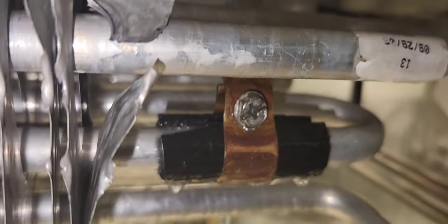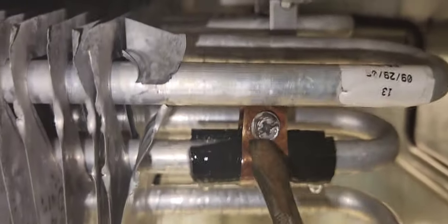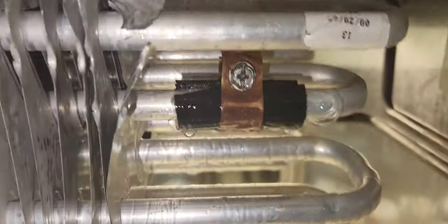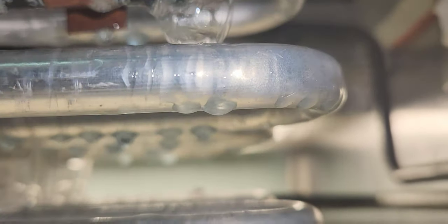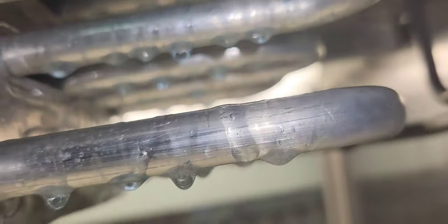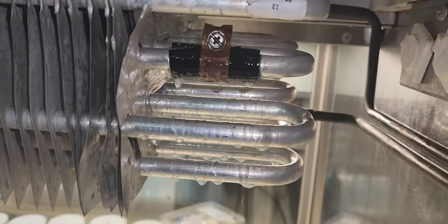So my hose clamps were too small, but I did that improvised, which is what we do. So there's my leak right there, you see? Now my camera didn't record it, I was too busy, but I was tightening it tighter and tighter until the bubbles disappeared. Also notice how I've got the clamp positioned and the rubber positioned, because my leak was on the bottom, so I've got equal pressure from the clamp all the way around and the maximum amount of rubber covering the leak on the bottom.